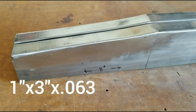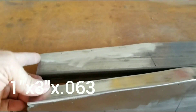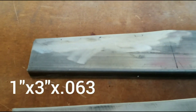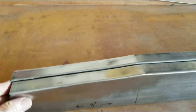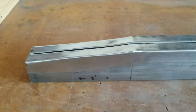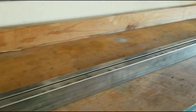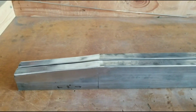I got it all welded up and ground off the excess weld — it's nice and flat. There's a little bit of a low spot I'll have to fill in later with some more welding, but right now it looks pretty good. They're symmetrical, identical side to side and front to back. So we're gonna call that step one done. The rest of the frame rails have a few more steps — we're gonna drill some holes for the axle, build the jig, and start putting this thing together.